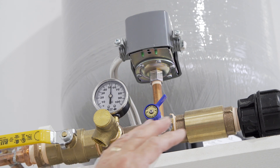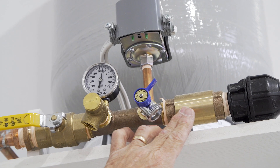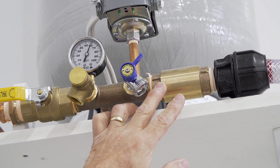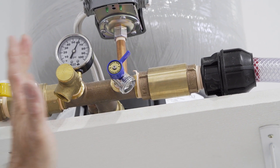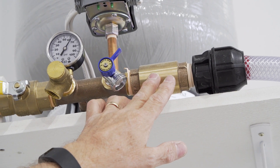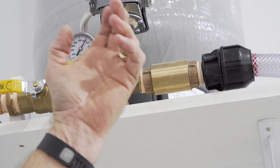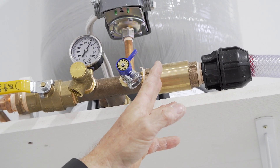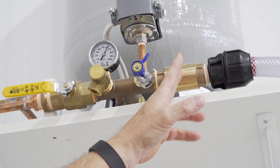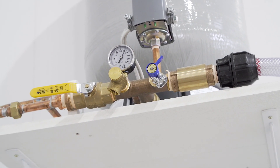While we're watching that, something important to note is that we put a check valve in the line here. Pumps have what's called a flapper valve, which prevents water from exiting back through the line and into the pump. This check valve works as a precautionary measure — it's like putting your thumb on the top of a straw. After water charges in through the inlet and reaches pressure, the check valve closes right there so that water cannot flow back through the pump.